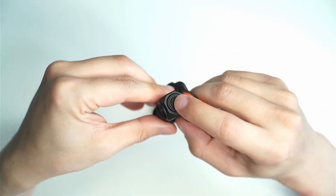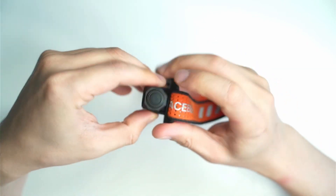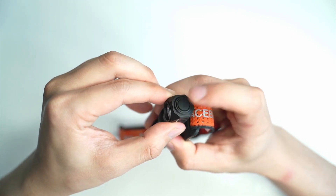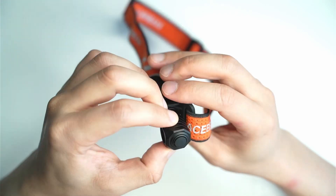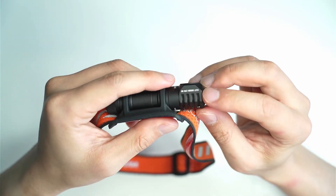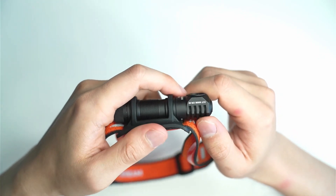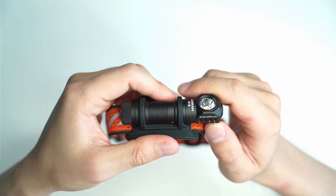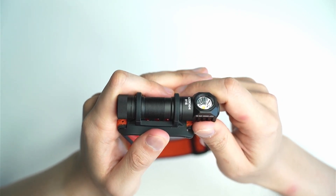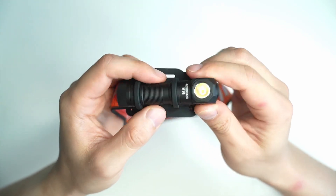The switch is located on top of the light. You've got to double press it — quite a firm press as well. It's not something that's going to turn on if you're just tapping it, so it won't accidentally activate if it's in your bag. Although mine comes with the Nichia 519A at 5000K, you can also get one in 1000 lumens and 6500K. Not sure what LED that version uses, but I'm thinking it's probably the Osram P9 — it looks quite similar to the PocketLit AA gray in terms of beam profile and output.